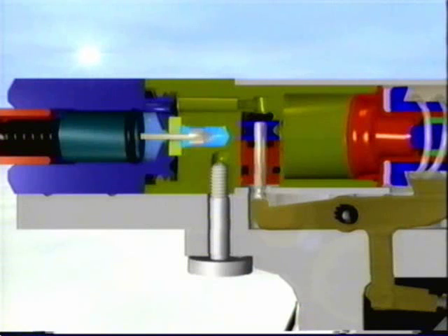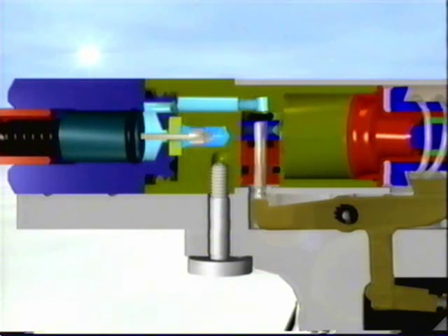Once entering, the high pressure air goes past the regulator seat into the piston area where it pushes against the piston, moves up through the transfer port to the top of the on-off valve, goes through the on-off valve and starts filling the air chamber.